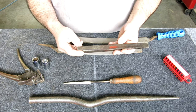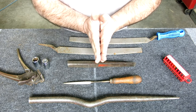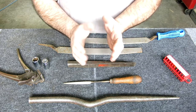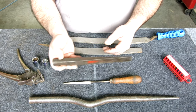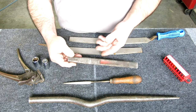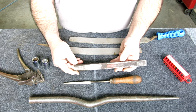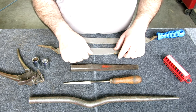This is a flange separating wedge. When you're breaking two flanges apart there's typically a little gap because they're raised faces, and you can get these in between, knock them in, and help spread them apart so you can replace gaskets. I almost always buy wedges if they're cheap because they're a pain to make and they're really handy when you have them around.